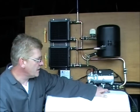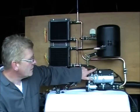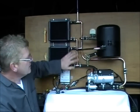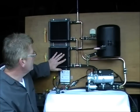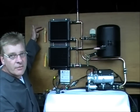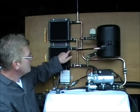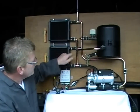The water flow on these heaters, that is the return, runs through the chamber, comes out here heated, and what we've done here to demonstrate is basically just create a small little heating system. We're using vehicle fan assisted heat exchangers here that draw air through, and these little ribbons will show hot air coming back. This could be plumbed hot air. So we come in the bottom and we return, we come in the bottom, return.